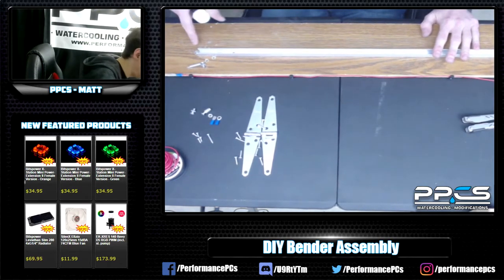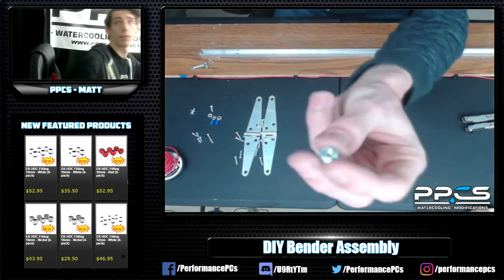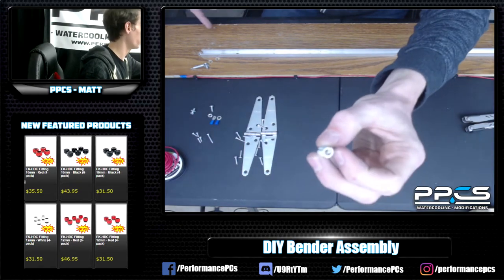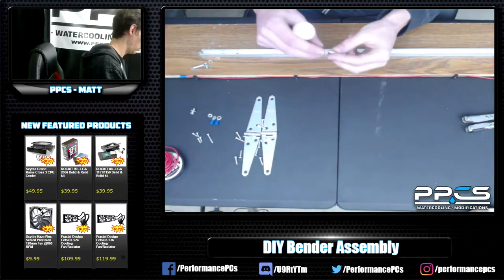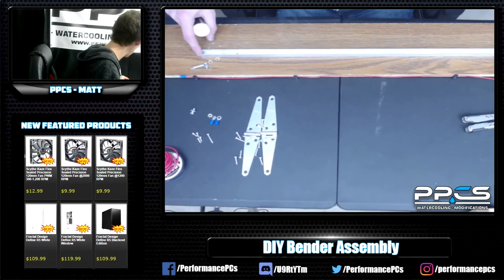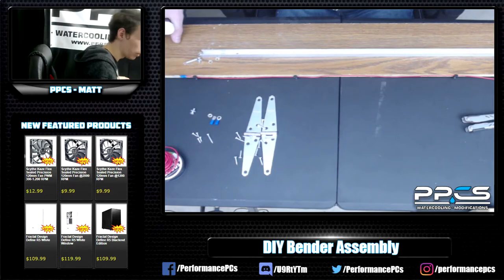Now, these are just threaded wood inserts — you can see one right here. This is literally just a screw-in insert; you use an Allen wrench to screw it in. You drill out a hole, insert this in, and then you have a threaded hole in your wood. That works really well for the few bolts you need to put in. I have three in total: two right next to each end to hold the wire up over and in the channel, and then one final one over here which is meant to hold the spring.